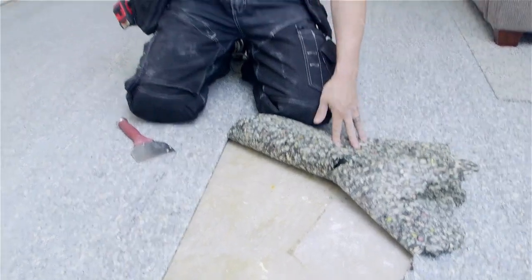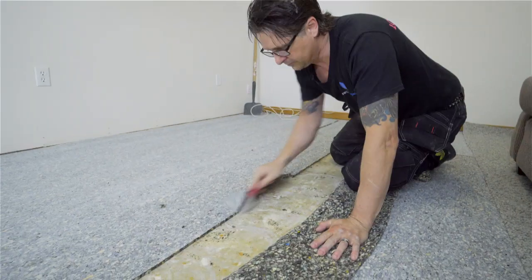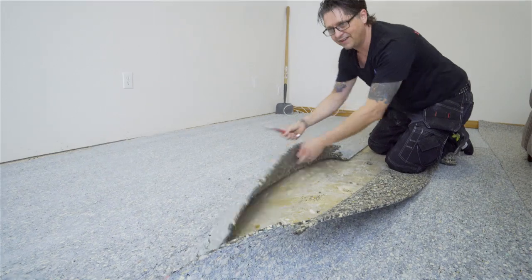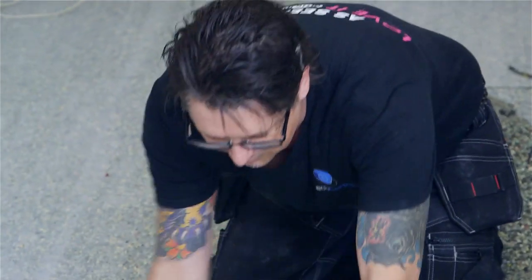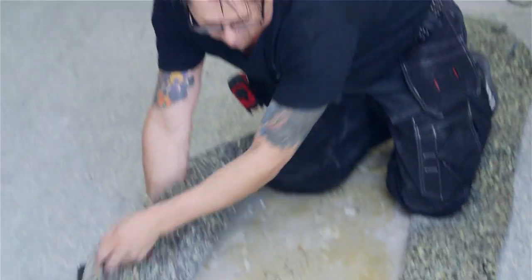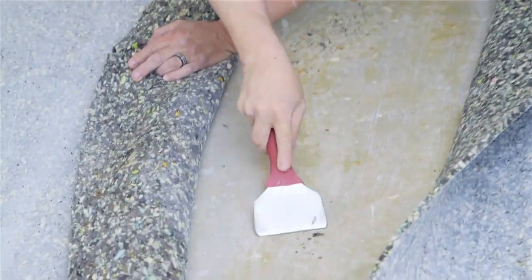If you have a leak or a flood, or animals that have made a mess on your carpet, all of a sudden it's stuck to the concrete floor. So what we like to do — and you'll see in the next video — is we're going to lay the new underpad out and we are not going to glue it, we are going to tape it. We're going to vacuum and clean it up as good as we possibly can. We think that glue is the wrong way to go. You can see that it's now stuck to the ground and you'll never truly get all that out.